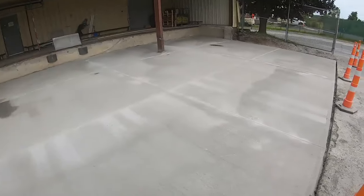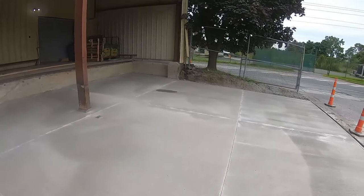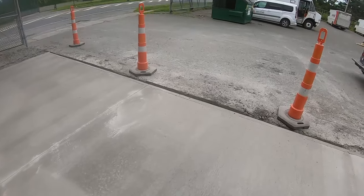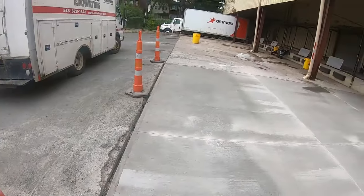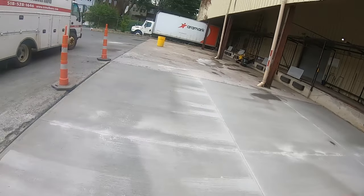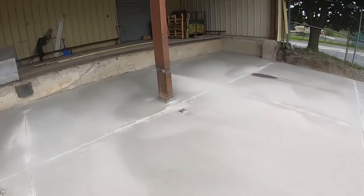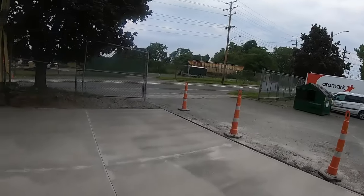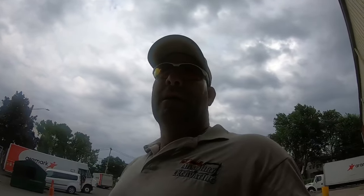Guys, this one's a wrap, all saw cut, 10-foot squares, 10 by 10. We'll be back Monday, which won't make the video, but we're just gonna cold patch this joint in with some cold patch blacktop, and this one's done for phase one. We'll be back for phase two over there on the loading dock for the tractor trailer ramp. We got to cut that out, and like I said, we got a change order. I got to come up with a catch basin and something to do with water.